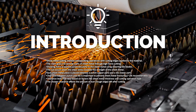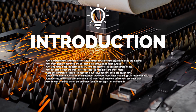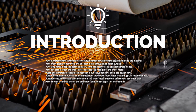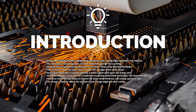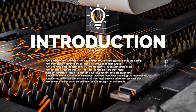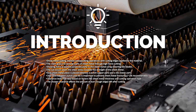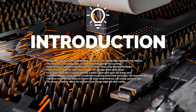Each sheet metal piece is placed between the punch, which is the upper part, and the die, which is the lower part. Clearance between punch and die is important to prevent sheet metal from fracturing, so 2% is recommended. Clearance level may vary based on factors like sheet metal thickness and cutting operation type. The chosen clearance affects the amount of burr, which is the rough edge, left after cutting.